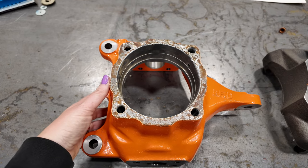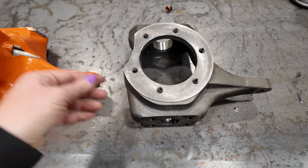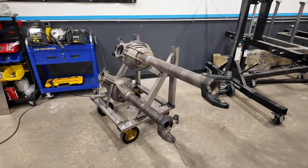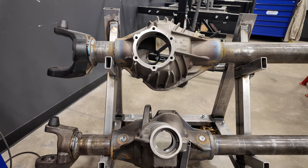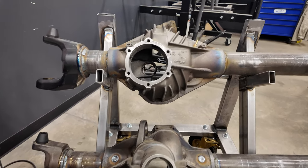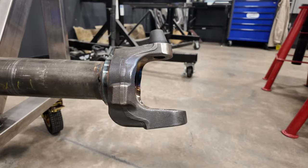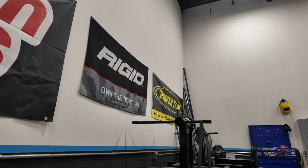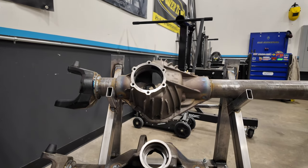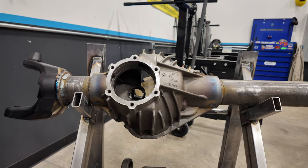So check these out. This is what's going to be going onto the Scottish hammer compared to what we have on Mischief Maker and Nessie right here. Even better still, let's head on over to the two separate axles. Now take a look at this. We're going to be working with a much larger diameter. That's 4 inches by a 1/2 inch wall tubing. And you can see how much bigger the C's are as well between typical aftermarket kingpin and the super kingpin C. So we're gonna be working with absurdly strong part that should last the test of time. Now, I don't know about you guys, but the side-by-side really helped put things into perspective for me. And I hope the crazy size differences between the two setups translated here on video for you guys.